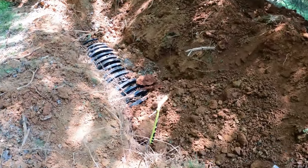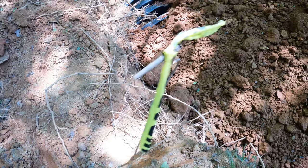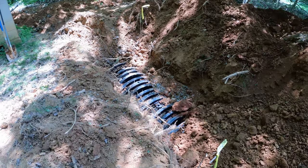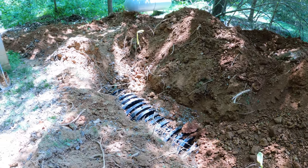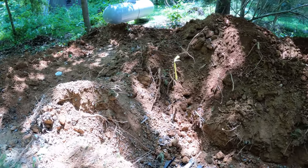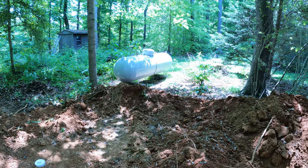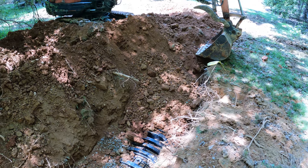We've got this propane line right here that we hit. And so I've got a buddy who's gonna come over here. He wants to braze this back together. And then there's the other side right there. So I was going to use some flare fittings. I was talking to my buddy who does heating and air and runs gas line all the time. He said, no, you want to braze it, just in case you don't want propane leaking underground and leaking away all your propane on you. So we'll be back over here, hopefully in the morning, to finish this up.